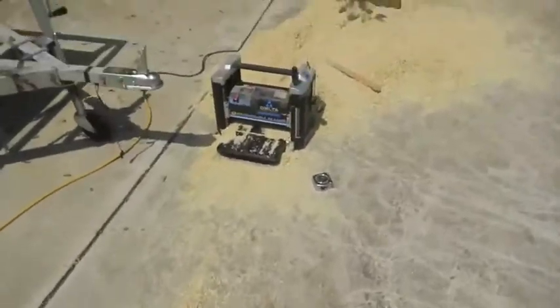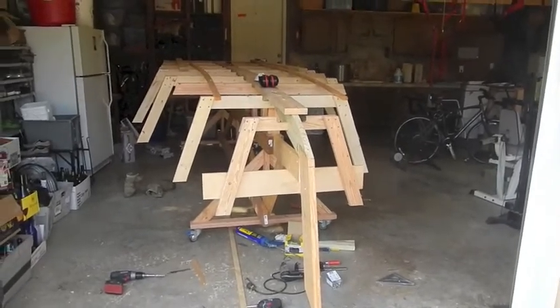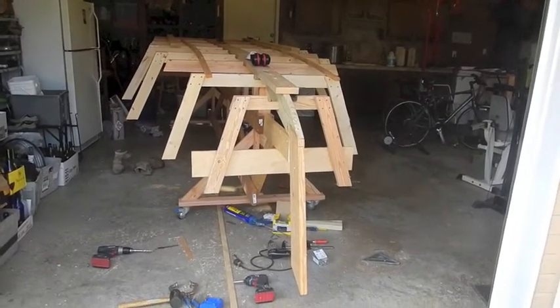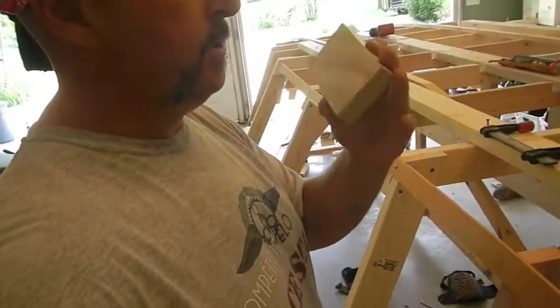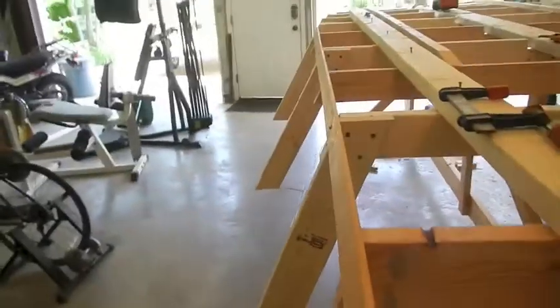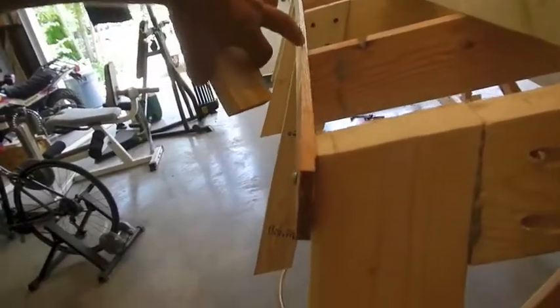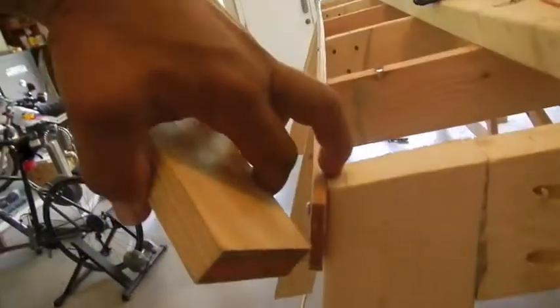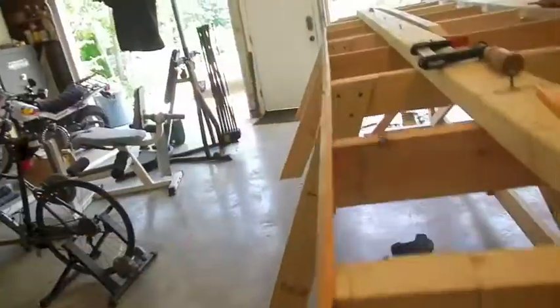Here's the aftermath — that's where I'm at after three days starting from lumber on the trailer. I cut a piece of the shear clamp and chine log material, ran a batten strip, and checked the lines on it. I've got a little belly in here, so I'm going to take an eighth more out of here and probably a quarter more out of this. That will keep my arc going pretty good.